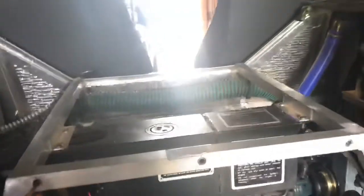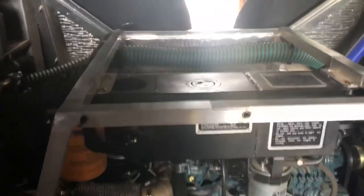Hopefully that makes sense. You can hear it right now - there's a clicking sound, and that clicking means it's calling for fuel. Fuel is going in and it's starting to heat up the unit. Now you can hear a fan that just kicked in, and there's air blowing out of this area right here - I'd estimate about 50 feet per minute, so it's not excessive and not that noisy. I've been told that if you come out about an hour before you want to use the unit and turn this on, the cabin will be warm enough to wear just a flannel or shirt sleeves. I've shut it off now but it continues to run until it draws off all that heat.